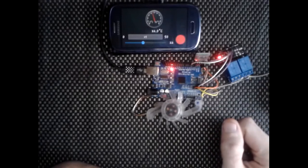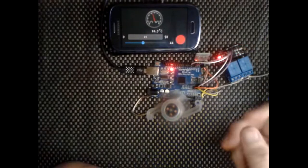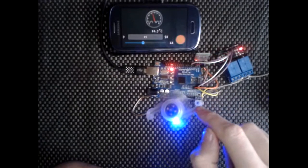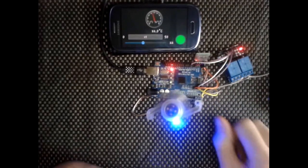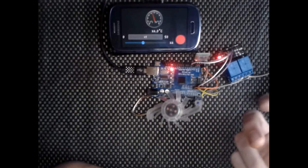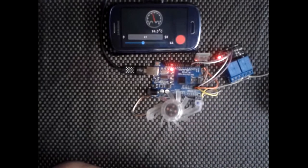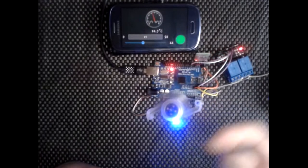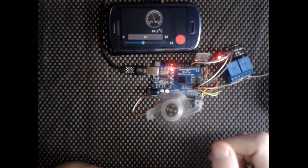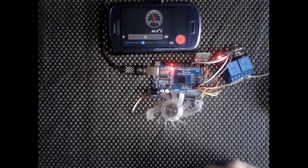You could quite easily be using a light sensor, some sort of photoresistor, where you'd be using your analog lines, so you'd be using A0, and you'd be using the voltage difference. You'd set that up how you wanted it to maintain a certain light level in a room. Let's say you wanted to turn a light on or off, you could add a time system to it. With the time chips, I did have one somewhere, but I'm not sure what I did with it. I don't even know what I'm talking about there, so ignore that.